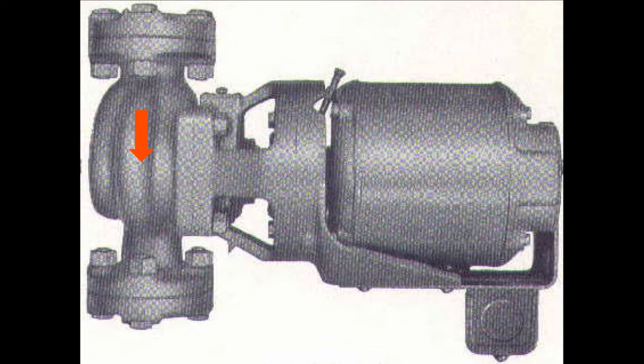So you got one pipe diverting water through a radiator. But when you go into really big buildings with that system, you find that the pressure drop through the tees is cumulative because all the water is flowing through all the tees. So you wind up with some pretty big pumps that have to move the water through all these monoflow tees or all these Venturi tees throughout the system.